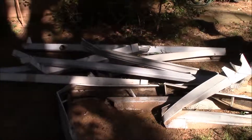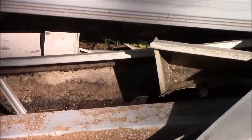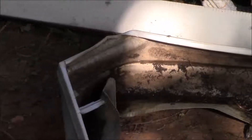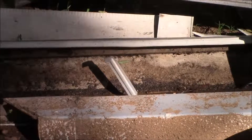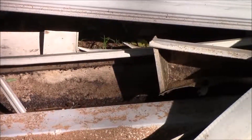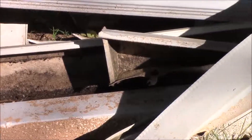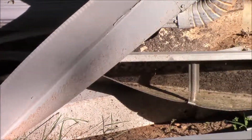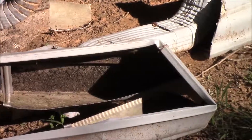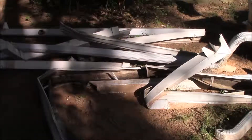One thing I want to stress — let me pan in here. These gutters, or at least the ones that I have, are all aluminum except for the screws that hold the pieces together. Even the brackets — the bracket you're seeing right in the middle there — it's aluminum also. Basically it's the nails they put into the back of the wood to put the gutters up, and also the screws that I'm going to show you here in a minute — they're both steel. And then the rest of this is all sheet aluminum, so you can get the sheet aluminum price.